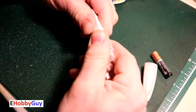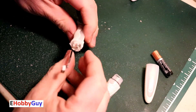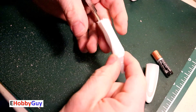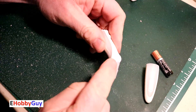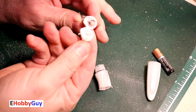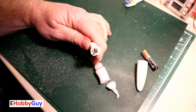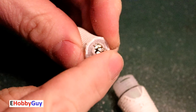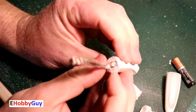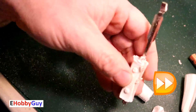It's thinned out a lot. Let's see — no need to go much deeper. Got that off, but it still seems locked in place. I'm thinking maybe I'll grind off this end because the switches may be holding it in place. Let's Dremel this end — there we go. I can see the eccentric mass, the weight. That was a good spot. Let me zoom in — there's the eccentric weight that creates the vibration.